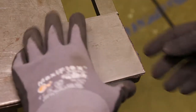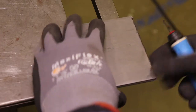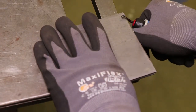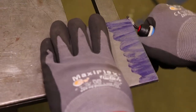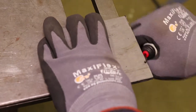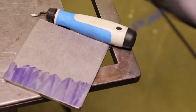Both of these cutting processes leave a pretty sharp and gnarly little burr on the end of your material. You can remove that a lot of different ways, but one of these little deburring tools is pretty handy. It makes pretty quick, and quiet, work of light burrs in material — you just draw it in towards yourself and eliminate that sharp and rather dangerous edge that comes from cutting. It doesn't take off heavy burrs, which you'll have to hit with a file, but it makes pretty quick work out of light ones.